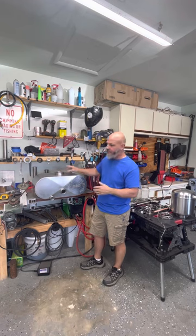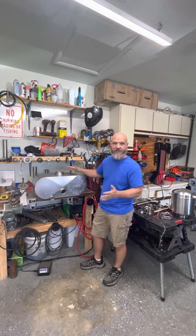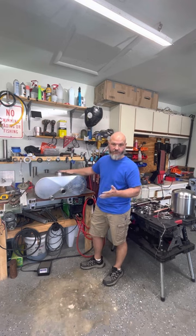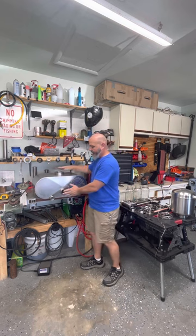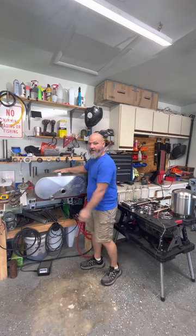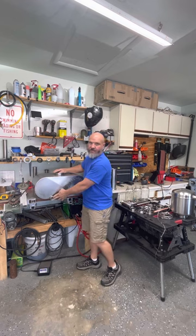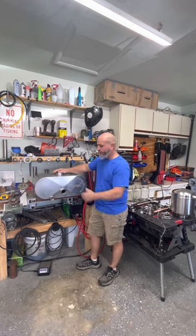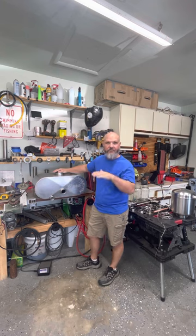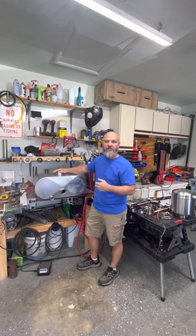Running capacity is about 10 gallons — you need to have a little bit of headspace in there. This tank is your standard base model version. You're going to have a 4-inch triclover fitting up top, a 2-inch in the center, and a half-inch NPT for a drain. This one has a 1-inch triclover ferrule as a prototype, and we changed it a bit to help keep the price down for people who want a nice setup but still be affordable.